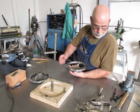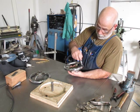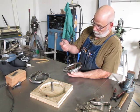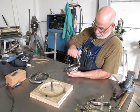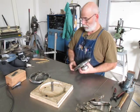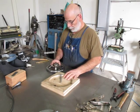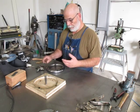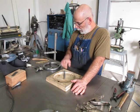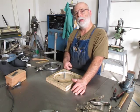That one's kind of done. I do have to insert the handle back in here, so I've got a little cleanup to do. I'll probably press that back in - it's a non-rotating handle for whatever reason. It almost goes now, but I'll get it up on the mill and clean that hole out a little bit, then press it back in. So that one's set aside. Now I'm going to go fix this fixture up and get set up, then come back and shoot some more video so you can see some of the repairs.